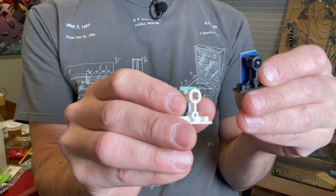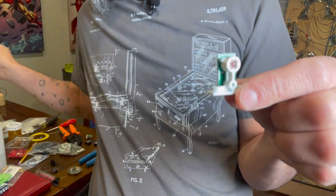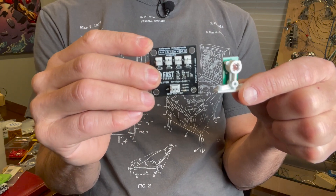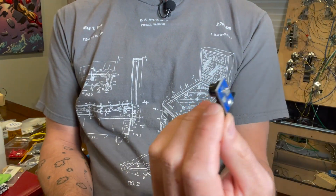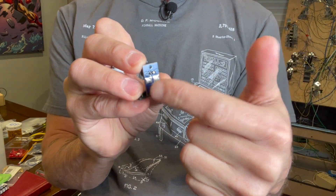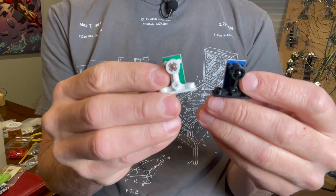On these ones we've got black and we've got white. The white is the emitter — the one that gets wired up and connected to this little Fast infrared opto board. It controls the power and makes sure these don't get burned out. The black one on the back just gets wired up like a typical switch: one wire is a ground going back to our I/O board, and one is the actual switch input going into the switch receptacle on that I/O board.